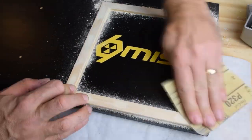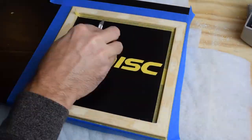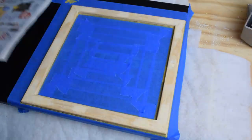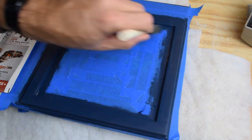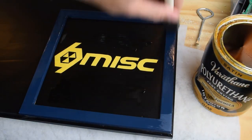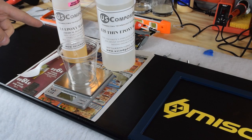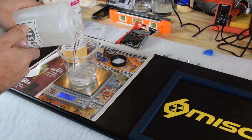After the wood filler is all in there, it's all sanded off nice and smooth. We are going to mask it all off and paint it with our trim paint — a nice deep blue, the same deep blue as the walls in my home theater so it kind of matches. Now roughing it up a little bit so I can put a coat of polyurethane on there to protect that finish also. Now this is a two-part epoxy that I used for a clear coat because the surface wasn't particularly smooth.